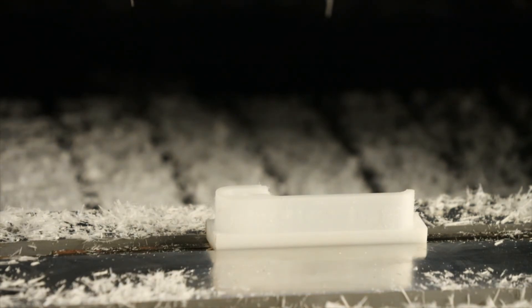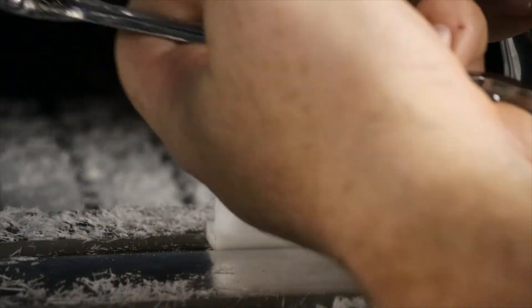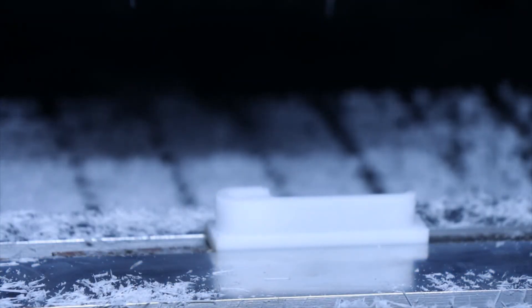You can see we're relatively burr-free, but I did want to put a slight chamfer on the edge, so I did a final operation with a chamfering cutter. I'm going to load that up right now and show you that last operation. I'm actually hitting cycle start twice because I've got an optional stop, so it's got to clear the op stop as well as the M0.